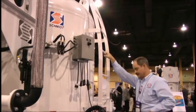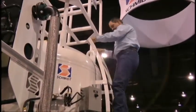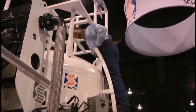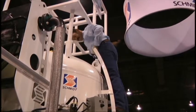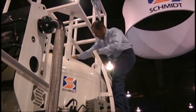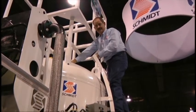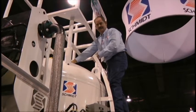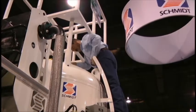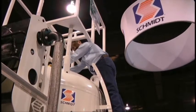As an example, when a man gets to this point and lays across, the ladder itself completely supports all of his weight in a comfortable position. Secondly, there is a grab bar handle up here welded to the top head that is also a certified point of attachment for fall protection. By laying over on that ladder with the point of attachment for fall protection, you have complete access to this 10-inch closure.